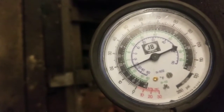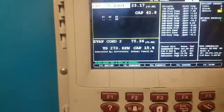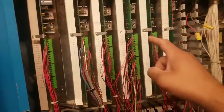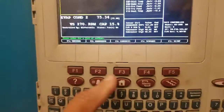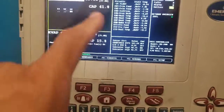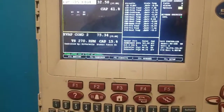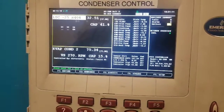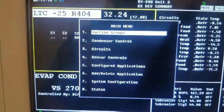Look what it's reading right now — 15 psi on the gauge, and it's slow. We've got 15 psi actual on the gauge and 33 psi on the controller. So obviously something is wrong. This is an E2 controller but these have control boards, and I went over this in another video but let me go over it one more time. The setup is different — it's not like you can just go to inputs and outputs and see all your boards and RO and AI points.